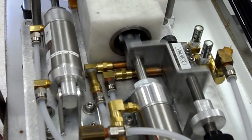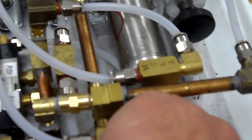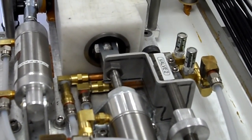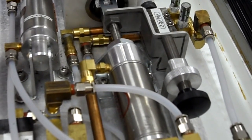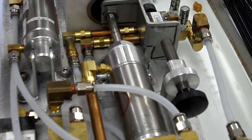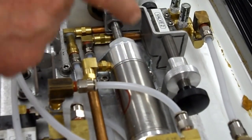Okay, now, the second little knob right here. This one is very important. This one controls the withdrawal of the intake of the filling, and the piston is going back. It intakes the filling. So you don't want it to come back too fast. You want it to come back as slow as you can get it to come back and stay within the cycle. Okay, so that's not quite in the cycle. It didn't reach it. Okay, that's just enough.